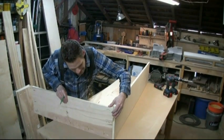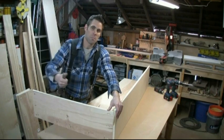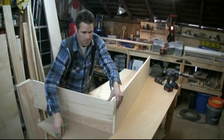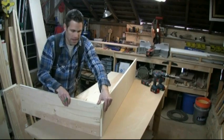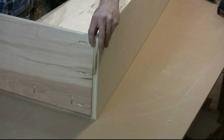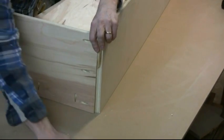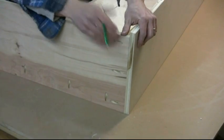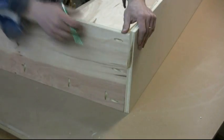All we're going to do now is pocket hole them all together. A workbench for this is really important — the one thing that's super important is a flat top. I just use a piece of scrap MDF because I want the surfaces down here to be perfectly flush. If they're off, when you put your face frame on there it won't sit flat and won't give a good connection. So make your life easier and throw down a nice flat surface. I like MDF because once I destroy it, I can throw it away — it's cheap and inexpensive. If you're at home, use glue. It takes two seconds to put a little bit of glue on there and then actually clamp it together.